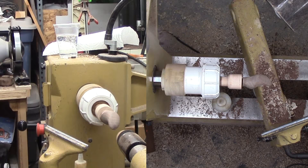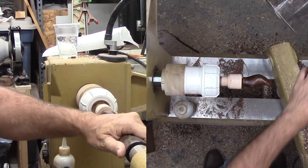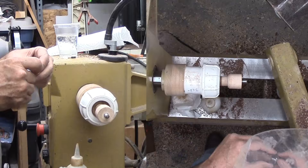Finally, I finished the walnut with shellac friction polish, although the friction came later from buffing wheels. Having the wood mounted to the steel provided a handle to use while buffing. A CA finish would be more moisture resistant than shellac. After unscrewing the wood and screwing on the stainless steel bottle stopper, I have my multi skew axis walnut bottle stopper.